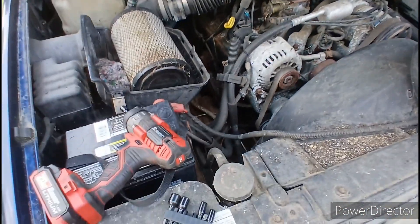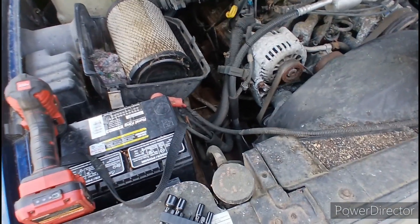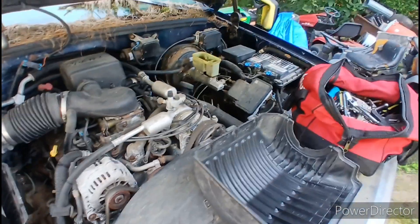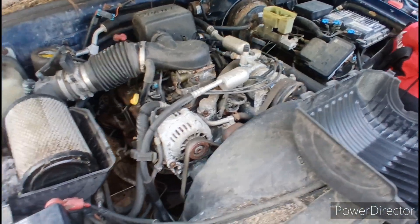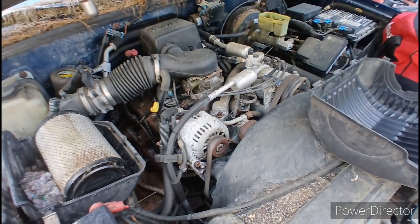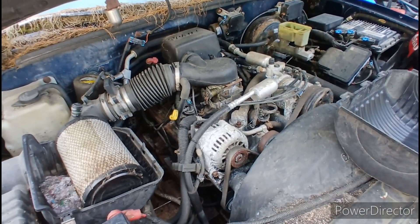I had to grab a new old battery to put in it. It turns over, and I ought to check for oil — well, actually I did that the other day, it has oil. So it turns over good. Doesn't sound like it's galloping or struggling. We'll get into this air cleaner, shoot some ether in it, and see if we get something to happen here.